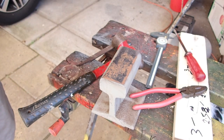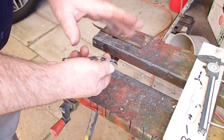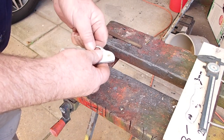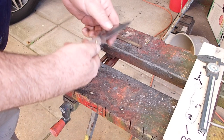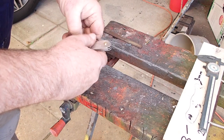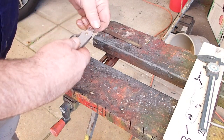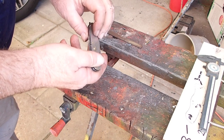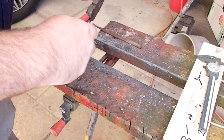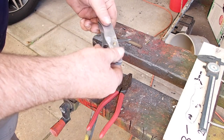We're getting progress. I've taken this to the metalwork vise, wrapped the blades, and gave it a bit of a wiggle — which is actually setting the tension. It's just about where I want it and it gets that nice snap it should have. I'll put a bit of lanolin on there, get all the tools out — everything snaps good. Still got to work on the ream a little bit, it's a little tight. I'll lubricate this up, work it a few times, it's not far off. Then we'll put the handles back on and we're done.